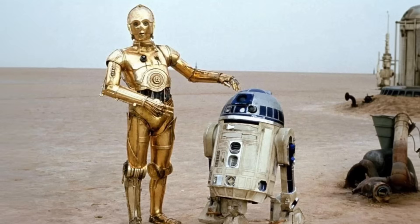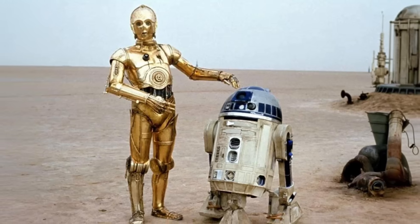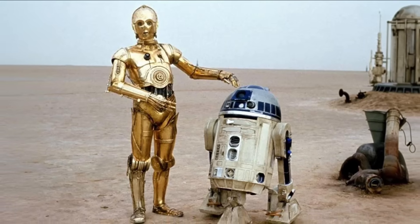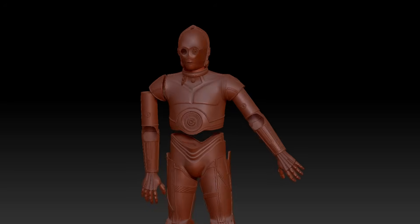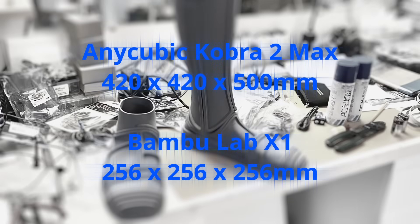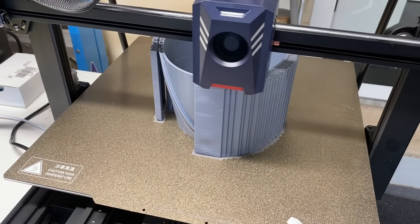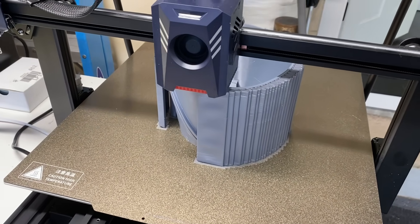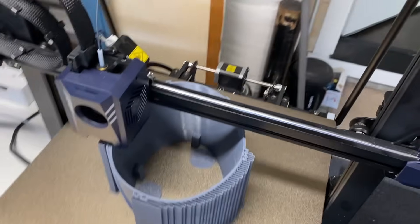I'm planning to build both robots as animatronics and not static props. Let's get started building C-3PO. I started this whole process by searching for all the individual parts, which can be found on various websites. I unpacked and assembled them in the program ZBrush. I started the month-long process of printing them using two printers. It's a time-consuming process and will always require a lot of cleanup, but there's something freeing as a builder having the files already made for you.